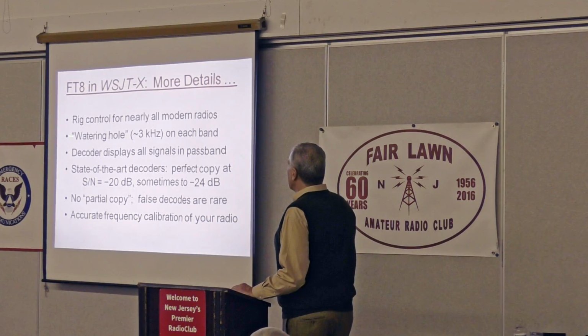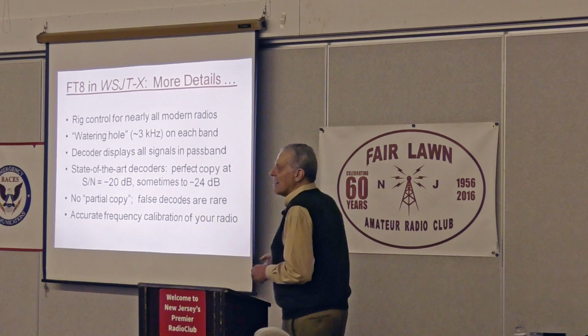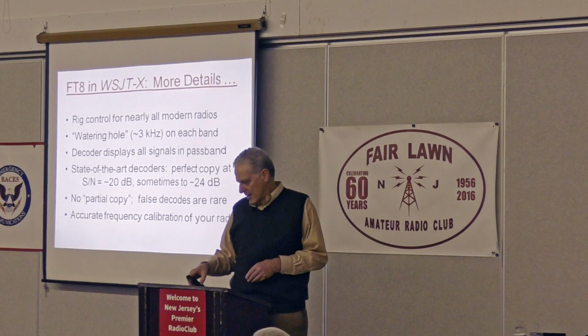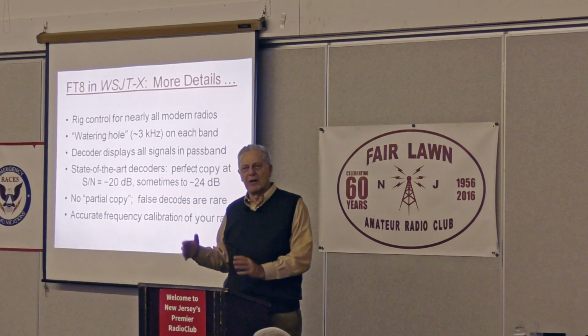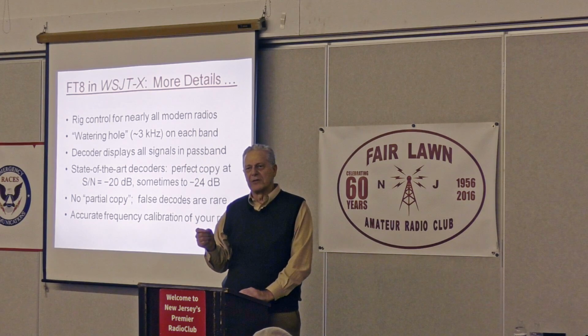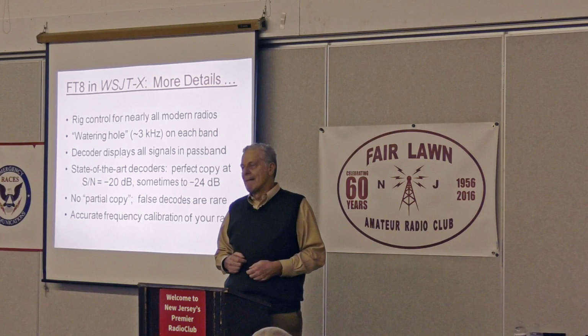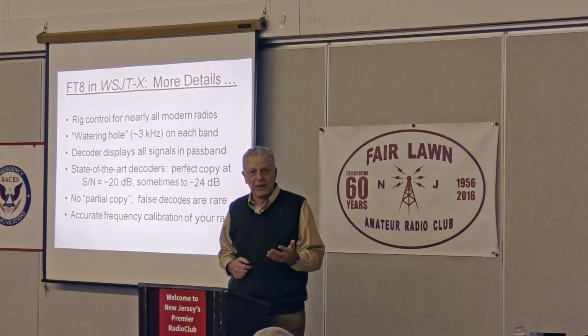We have more or less encouraged having the use of our bands dictated by default frequencies that are in the program. So if you select 40 meters in FT8, it will set your dial to 7074. There's no real reason why it has to be there, but we picked those frequencies after some significant amount of discussion with the community of users to pick a frequency that's good the world around and things like that. But other frequencies would also be okay.